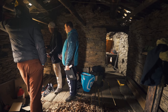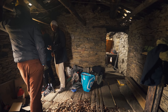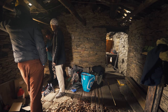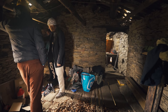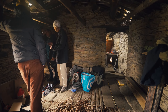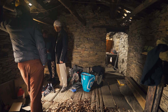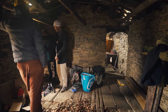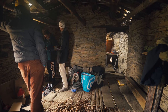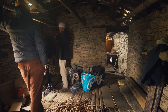There is a big paperwork to do in the region of Piemonte, because here we are in a high seismic zone. So you need to make a seismic permit, and it's not cheap work to do here, because you need a meter between the corner of the wall and the door. So this is existing, so no problem. But if you touch it, you have to stay under the law, and the law says that from this is 50, so you need the other 50 of a wall. If you have no, you can't touch.